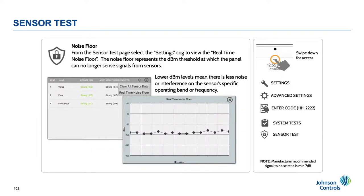The sensor test is an amazing tool that makes the invisible visible. It includes a traditional packet count function, but also measures the actual DBM from each sensor. This is all viewed from a simple summary screen, allowing the technician to walk test the premise, tripping each sensor along the way, then returning to the panel to get detailed results. For a more detailed view, each sensor can then be plotted on a graph where they are measured against the ambient noise floor.